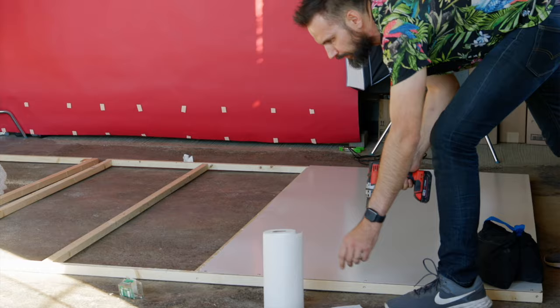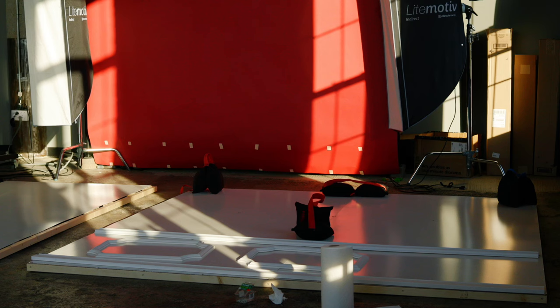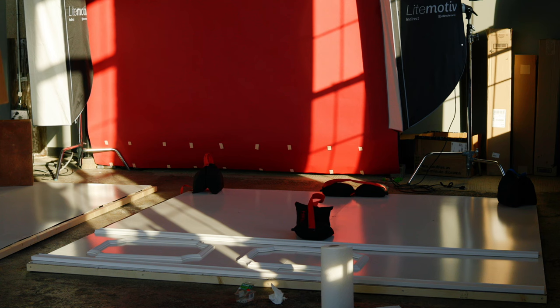When I went to assemble the smaller wall I found it was actually square, and I glued the molding on top. Because I would have molding in known locations — like the baseboard and the chair rail — I could put screws in at those spots to secure the panel. To further ensure the panel adhered to the frame, I used sandbags and apple boxes to weigh it down, then let the whole thing sit for several days while I was out of town teaching a workshop.